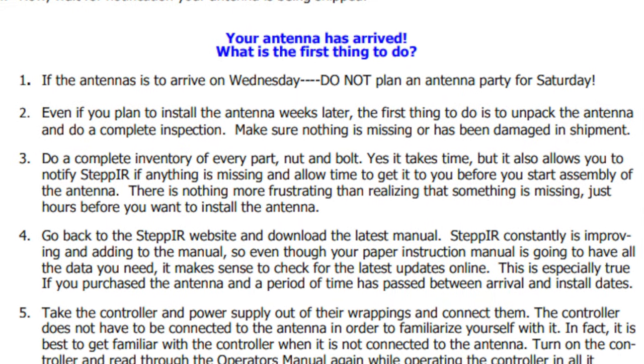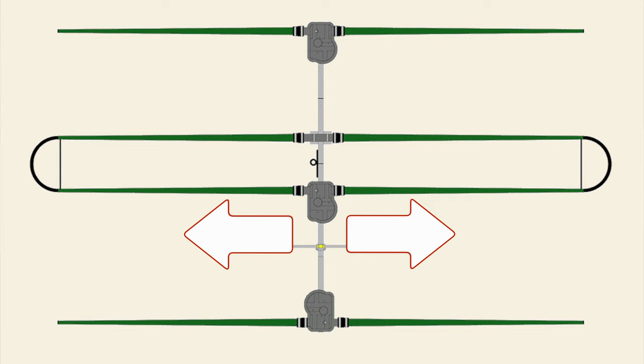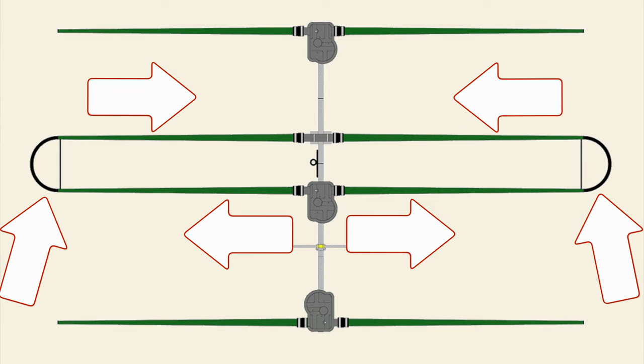The things to remember about this antenna, which separates it from some of the StepIRs, is not only does it have horizontal elements that act as the reflector and the director, but the center elements also do that — they come straight out, and it goes 20 meters all the way down to 6 meters, and you get a perfect tune, perfect match. Check out the interview I did with StepIR during the Ham Radio YouTubers Bunch Ham Fest. What separates this one is you can put it into a 30-meter or 40-meter dipole as well. The reflector and director retract, and then the radiating element extends all the way out until it hits a U-turn on the edge of the beam and folds back around, functioning like a folded dipole, which gives me a lot more capability in the small lot that I live in.